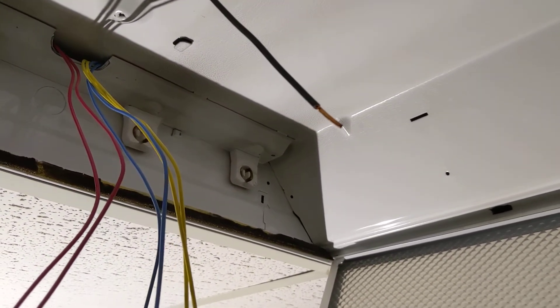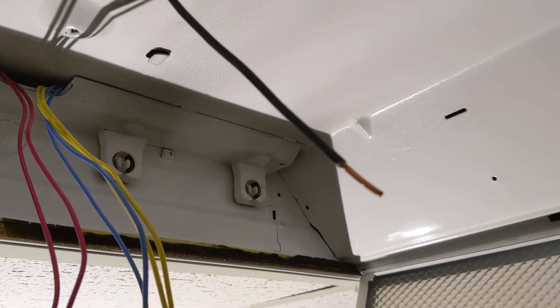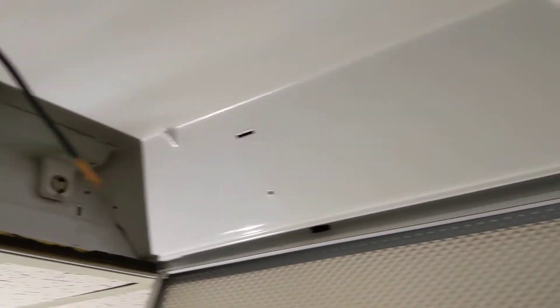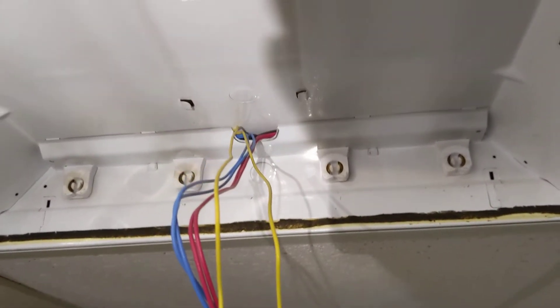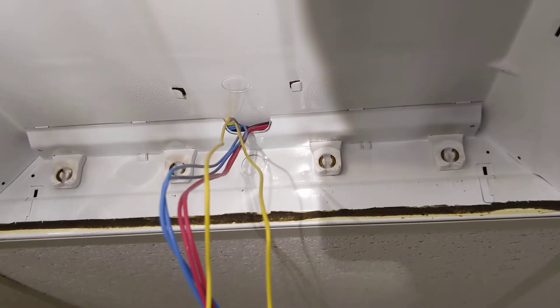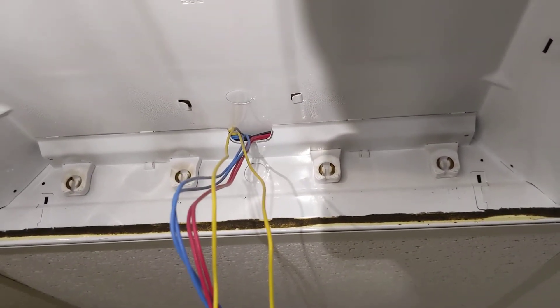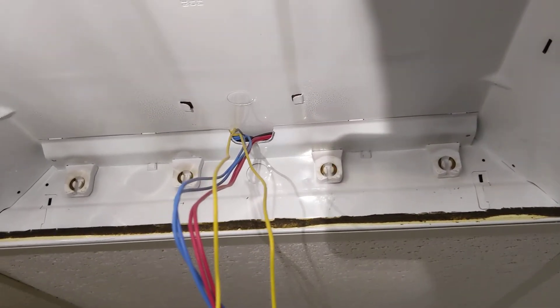Once you do that, you're using your old tombstones or sockets — you just plug in the bulbs just like normal. They're one-inch bulbs, they look like T8 bulbs, and they fit into these standard one-inch sockets. Once you've done that, you wind up spending — I bought 50 bulbs at $6.88 a bulb, so you're right around $26 per light to do this.